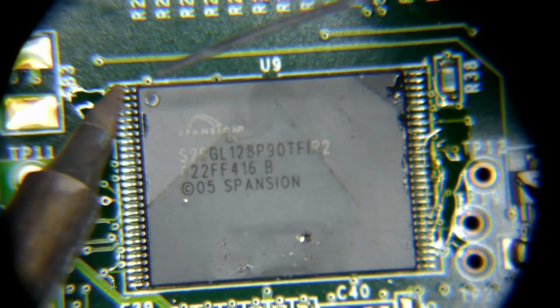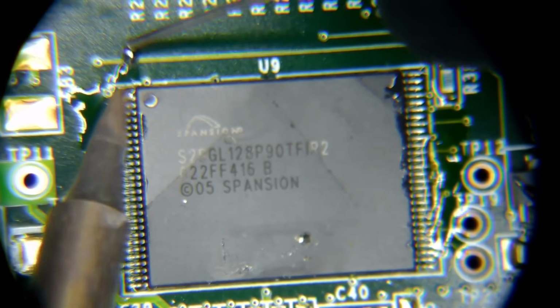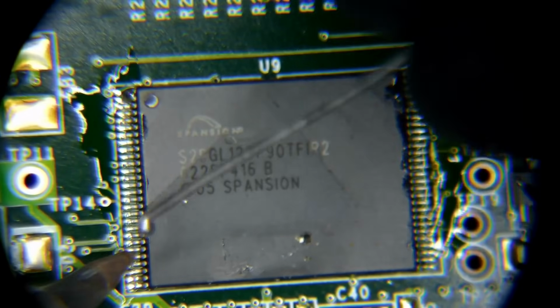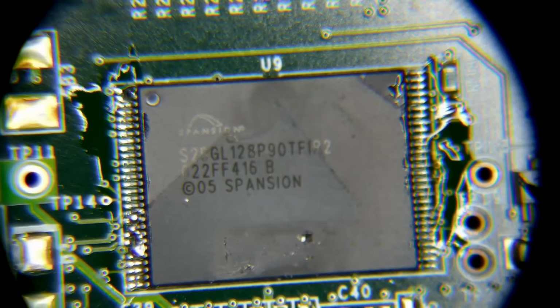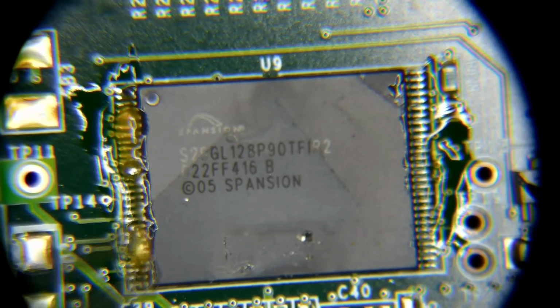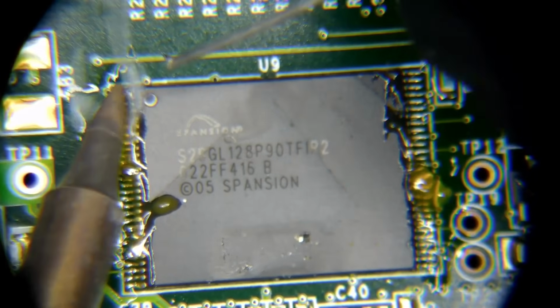That will really help pull it, because these devices a lot of times when they're made, they use lead-free solder in the manufacturing plant. It's probably a little cheaper. I don't know why, but oh gosh, this is terrible. We need more flux. I just want to drag solder over this. Come on, guys.